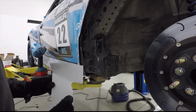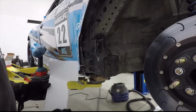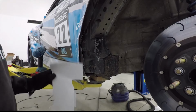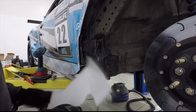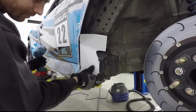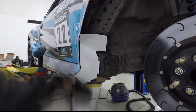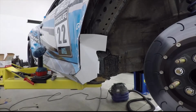Basically, I start with a single location, and then I will work my way out from there, drilling, then riveting, to ensure that it basically fits as best as it can. I'm also going to stop talking now so that Clay can speed it through it. But yeah, here you go. Oh, and as far as tools, I have a drill, I've got a bunch of rivets, and then I have a pneumatic rivet gun. And that's all that it really takes to do this.